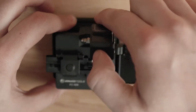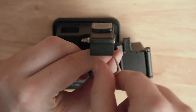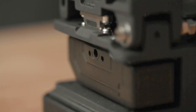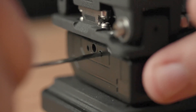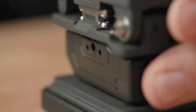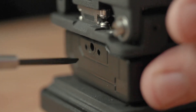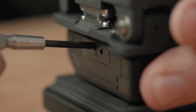If you are noticing the blade is dull, you will need to change it to another position. To do so, first open the cover plate and remove the fiber trash can using the 2mm hex key. Next, using the 1.5mm hex key, loosen the 2 screws on the sliding block cover. Using a precision screwdriver, rotate the blade until the next number of the blade is visible. Finally, reassemble the sliding block and trash can and you'll be able to start cleaving again.